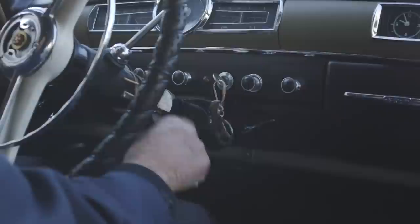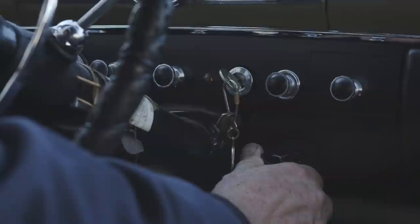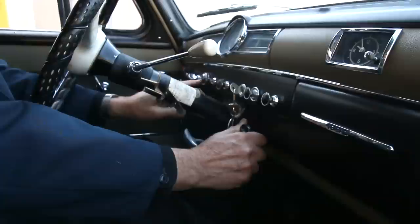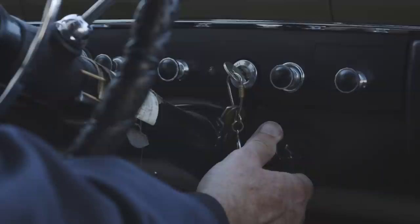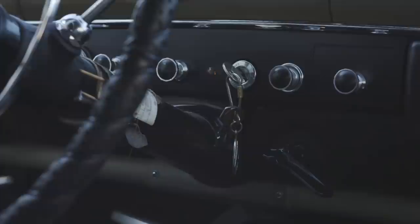The sequence begins by turning the key on right there. You'll get the indicator light that your ignition is on. Then I'm going to reach for the glow start lever, and I'm going to move it into the mid position. At that point, I will watch the glow indicator light right over here until it lights up. And as soon as it glows red, then I'll push the lever all the way down into the start position. And there she goes.